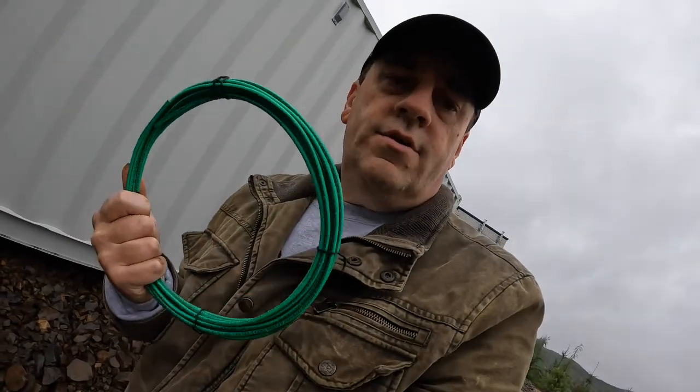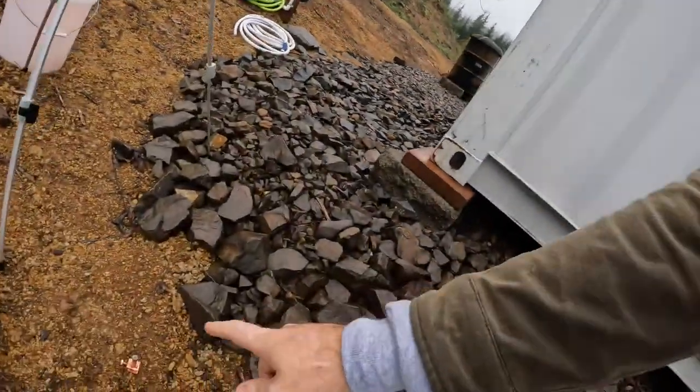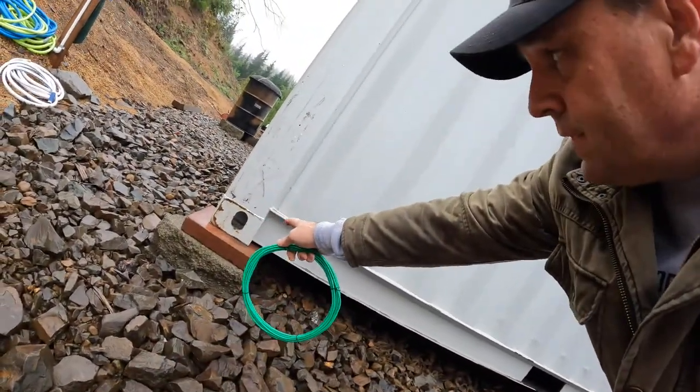So a little bit of nub sticking out — I'll put the clamp on that. If there's anything that looks like it could stab you when you step on it, we'll just put a little cap over it or a rubber ball or something. Once I get the clamp on and the wire in, I can drive it into the ground a little further and bury it. You can always find it because you just follow the wire backwards. This is the wire — it's just a heavy-duty solid core grounding wire. This wire actually came with this rod, so it's kind of nice that it's a complete kit. We'll run this over from the rod over to the container and screw it right into the corner using a machine screw.